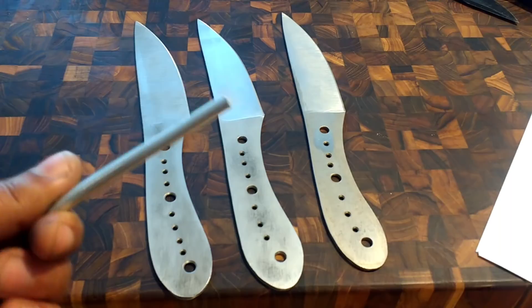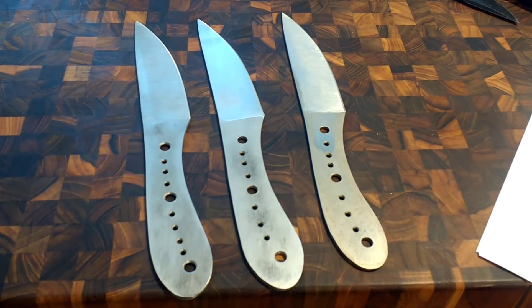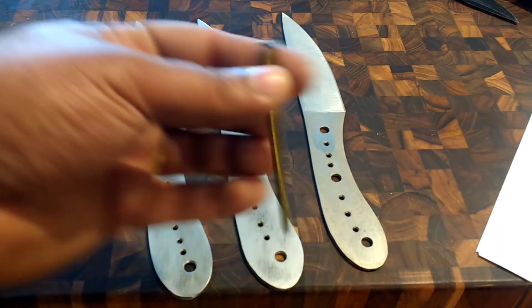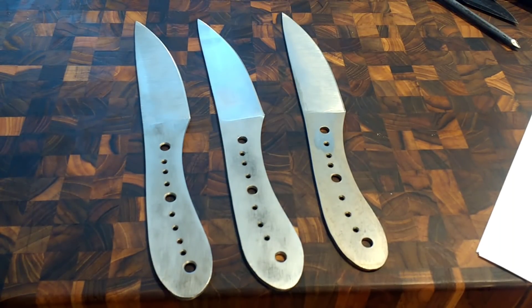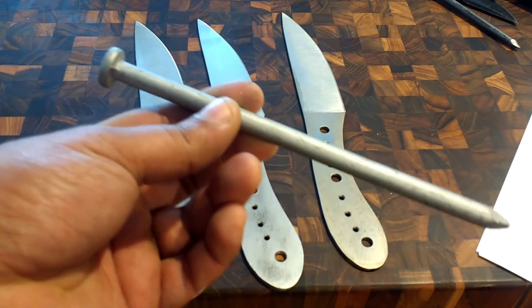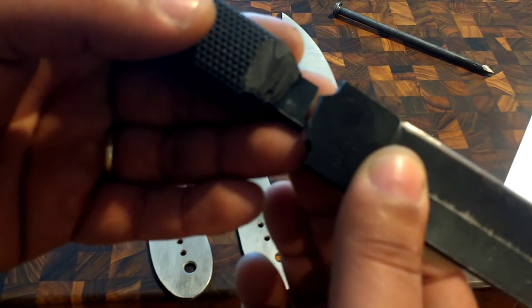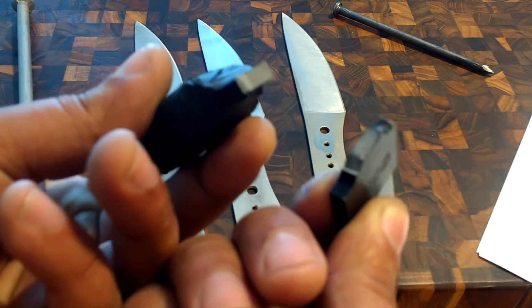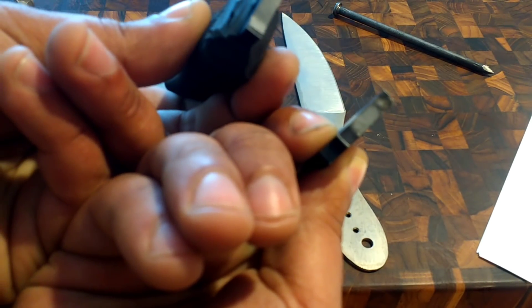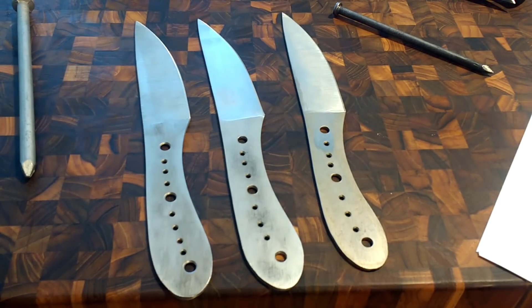I know a lot of people give me grief about how aluminum's not that hard — go put a crazy good edge on your knife and hammer through some aluminum and see what happens. It's going to damage your edge. After they survive that test, we'll try it on a hardened steel nail, then a bigger nail, hammering through until their inevitable demise. If they survive, we'll kill them on the Jesus nail — the one that unfortunately KO'd the Cold Steel SRK. You can see it failed right there at the transition point. The grain is very fine, looks like fine sugar. I think it's the design more than the steel — the hidden tang led it to failure.